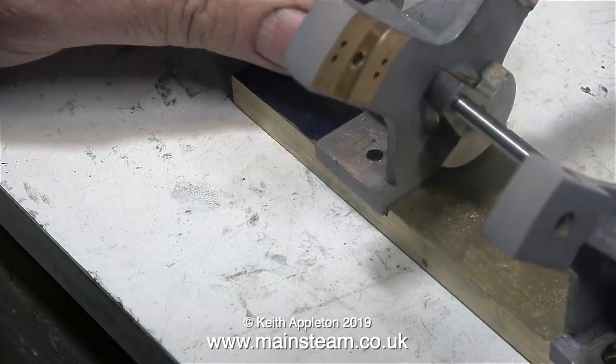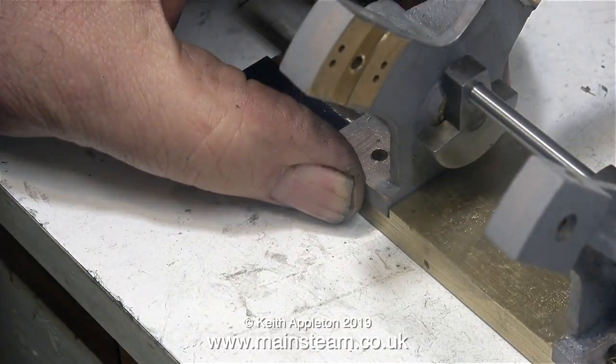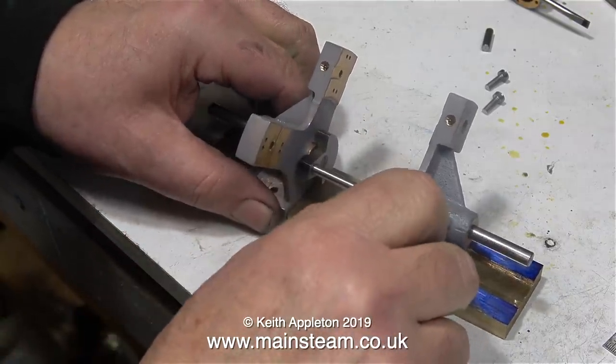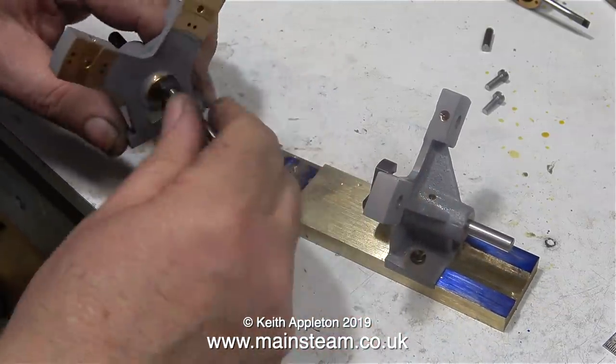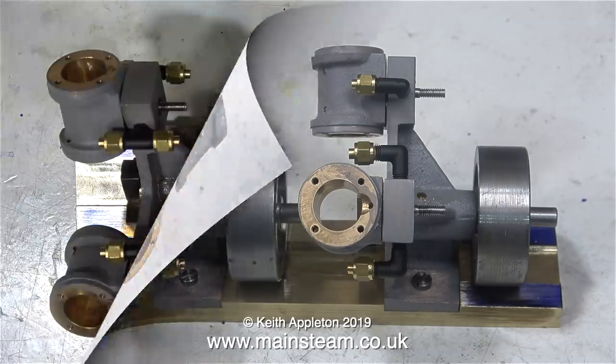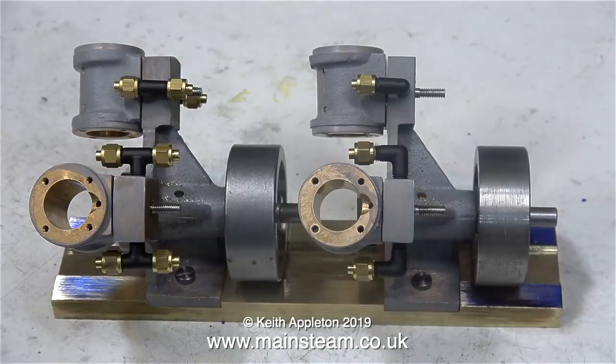As an experiment I removed the original crank pins by heating the part and withdrawing them — the Loctite gives way with heat — and I made a temporary one-piece crankpin. The problem wasn't my machining; even with the one-piece crankpin it still didn't feel good. So I'm going to apply Plan B. This is the final arrangement for the engine: I need to make a phosphor bronze catch plate to catch the end of the crankpin on the first engine on the right to connect it to the second one. I think this is a lot better, and the piping is greatly simplified. I want this engine to give years of service and be very reliable, and the simplest option is often the best one.